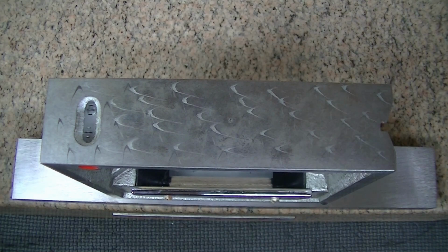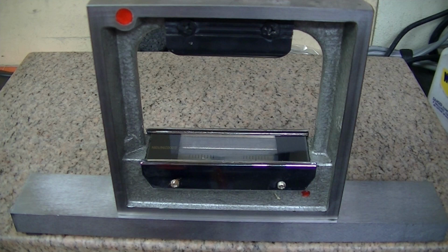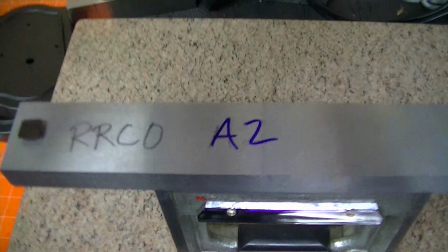So there's our nice 11 inch foot spacing precision level that's going to allow me to assess the condition of the plate to a darn accurate degree. And remember here, the benefit of the long spacing is minimal number of moves to see what's going on. So here's the feet. You can see what's going on here, the actual foot right there, the style of insert I'm using. Not that that's important, but just a flat top.